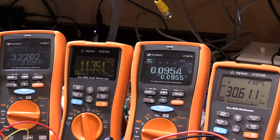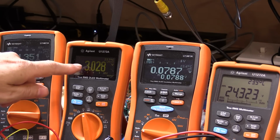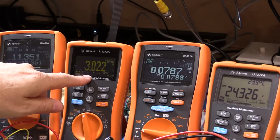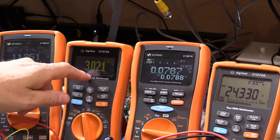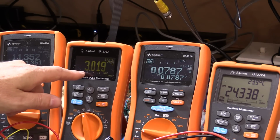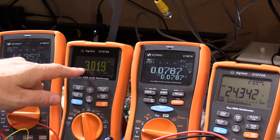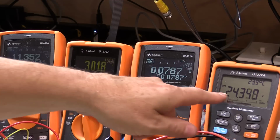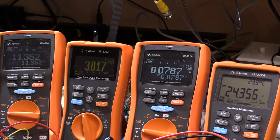The bulb is nicely on, and the volts is now back up to 30 volts, which is where I set it. And you can see here, if I turn the current back down again, just by a little bit, right now the current is in control. The current is about 1.5 amps-ish. The output of the current integrator is relatively low, 3 volts, which means it's pulling off the MOSFET to prevent it outputting too many volts. It's just slightly down, so it's sitting at 24, even though the set point is just over 30.